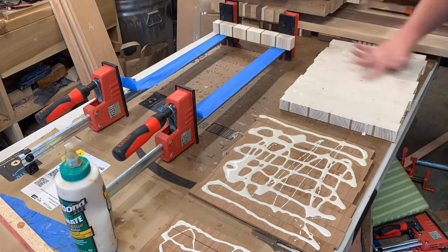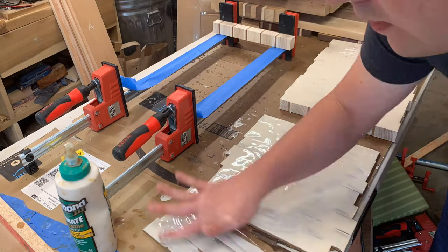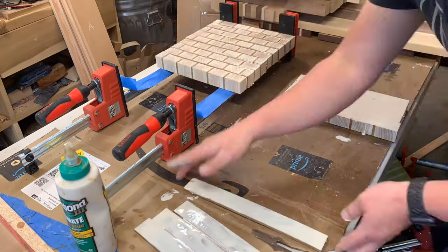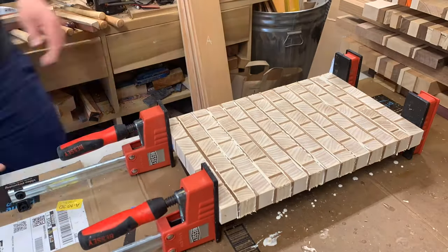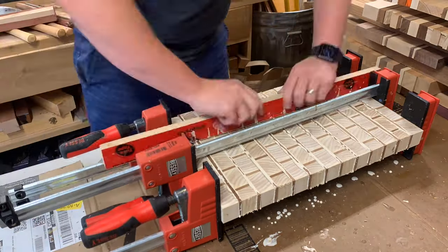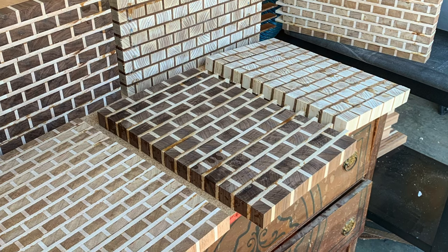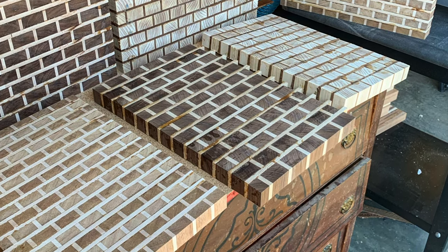For this last glue-up, plenty of glue — I always go heavy, it's worth it to make sure all gaps are filled. You really want to make sure it's flat however you flatten it — that's critical. Press it down with cauls to keep it as flat as possible. This is what the batch looked like before flattening — relatively easy to this point, but flattening is the next challenge.